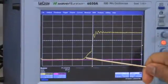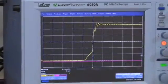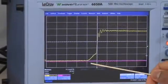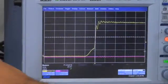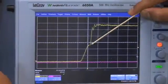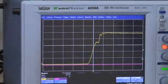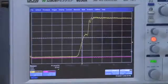Let's take a look at the resonant waveforms. This particular switch node wants to achieve zero-volt switching. This is the resonance at the switch node due to the leakage inductance and output capacitor of the MOSFET. We are at extreme light load conditions and it is extremely hard to achieve zero-volt switching. You can see that as I increase the load, you achieve zero-volt switching. Higher load current makes it easier to achieve zero-volt switching, which enhances efficiency and reduces EMI emissions.